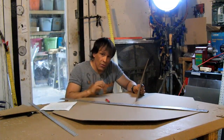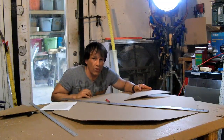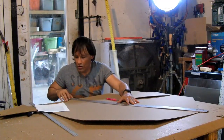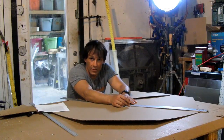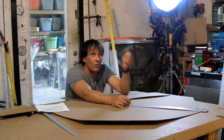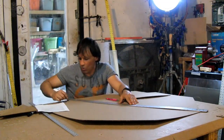Now the last number — 0.5419 — that number will find the perfect center. You have four lines that you can match up. You can take a ruler and go corner to corner all the way around, and where they intersect is going to be your center. You may not have the luxury to do that on a job site — for example, in a skylight you don't want strings everywhere. All you need to do is know one line corner to corner.